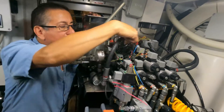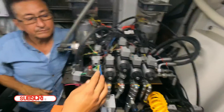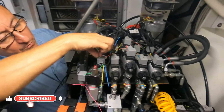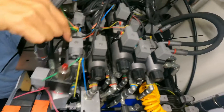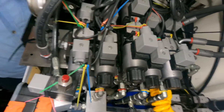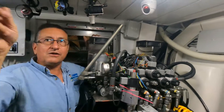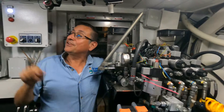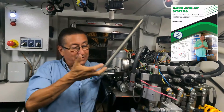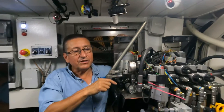This is for anchor down and up, because after that it's easy to troubleshoot the solenoid. But how can I activate from here? Look at this — you remove the screwdriver here and it's a solenoid. You see the pins 85 and 86. You bring the battery of a drill with alligator terminals and apply 12 volts directly over there. If you hear it going down, the problem is not the solenoid. In the auxiliary class I'm going to play with one of those and explain how they work. This is the central hydraulic unit.